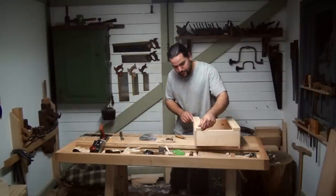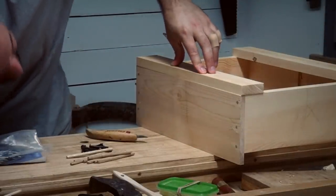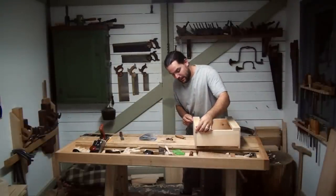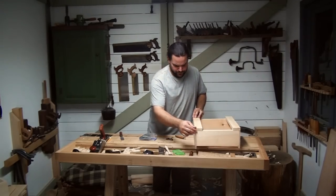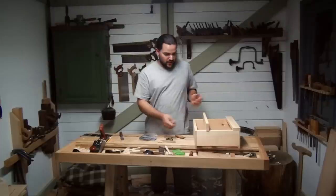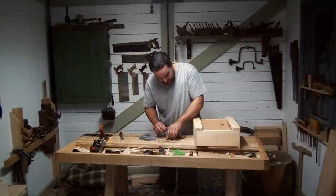Before we fix the face frames down, we want to have a good check and see how well it fits — just put some hand pressure on it and see how tight your line is. That one's spot on; that one's pretty good. I've left them slightly over length as well, because once everything is connected and fixed we'll flatten the whole of the top and bottom as one — it's better than ending up too short. There are a few ways we can fix these on: the first is obviously just glue, which would be more than enough for something of this size. If you wanted to make more of a feature, you could use wooden nails like we did on the carcass, or some cut nails or blacksmith-made nails — they'd look nice as a decorative feature.